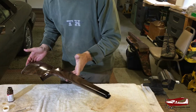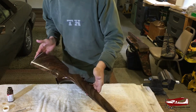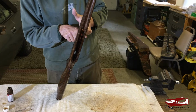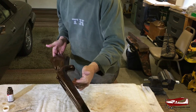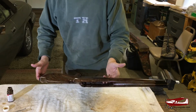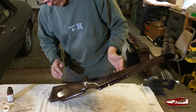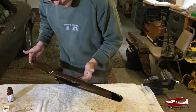There'll be little marks on it, just hand rub lines, which you can polish off later with very, very fine steel wool, very, very lightly, and then wax it with regular furniture polish wax. Hopefully that's showing the light on it. And while I'm doing it, I'm seeing areas that need a little quick brush. There we are.